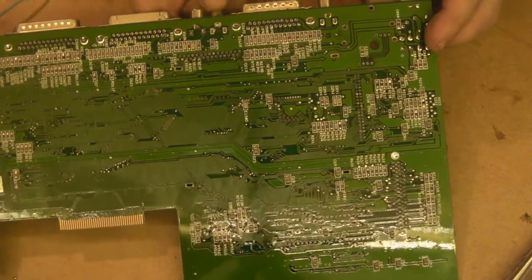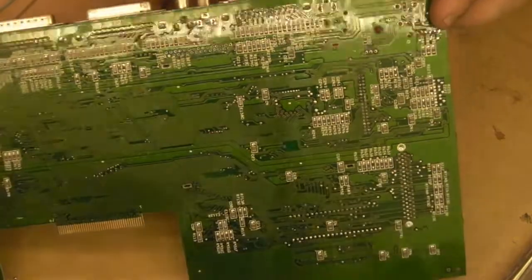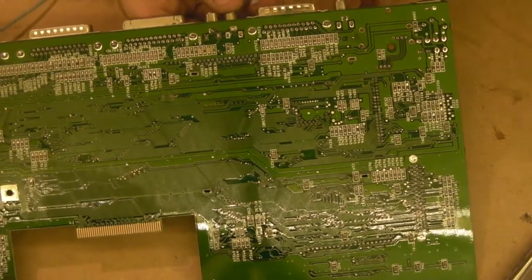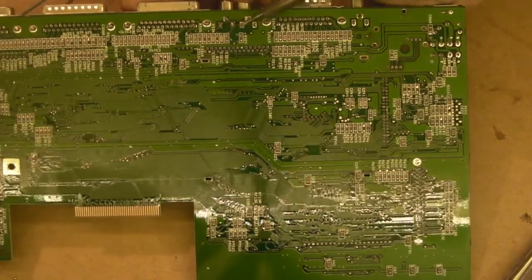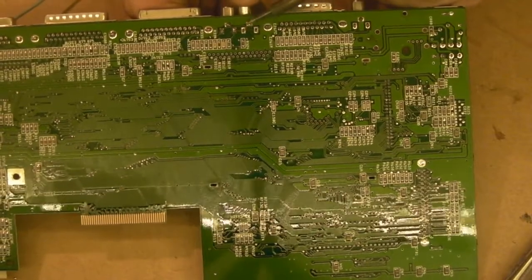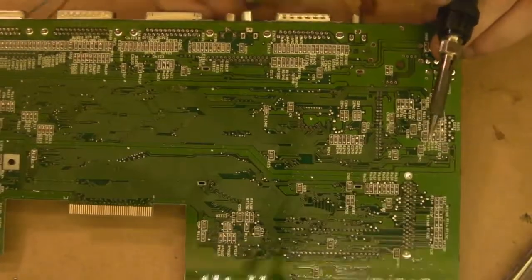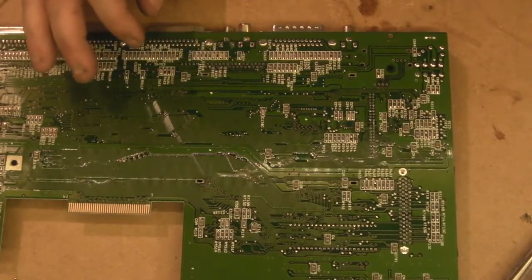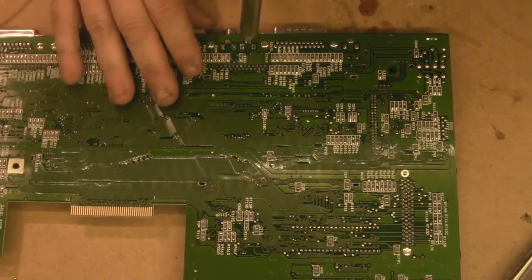A little bit stiff still. Oh, it's come in now. Yeah, it just needs a little bit more heat on that front pad just to help it come out, and we'll clean them up. Something's just holding that. Don't want to put too much force on it. It's out there. It's just that front one. Like I said, we might just try putting the pump back on it. See if there's a bit more solder we can wick away.